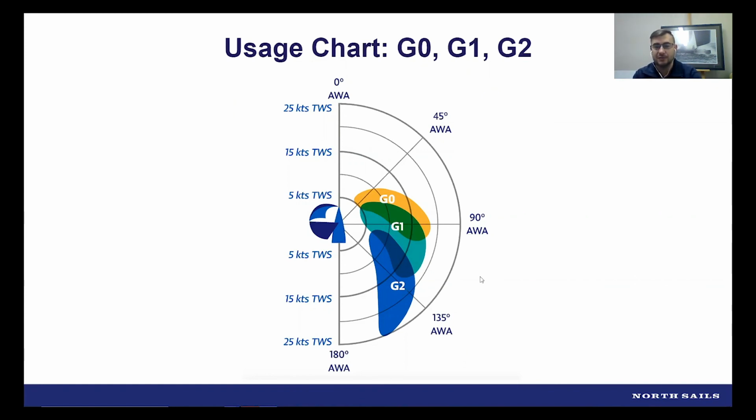One of the tricks that comes from the skiff days is with an asymmetric spinnaker, if you're jibing around the outside, you need to ease loads and loads of sheet. Make sure it comes off the drum and that you're ready to tail in. If you're jibing on the inside, you need to hold the sheet for just a little whisker of time as you go through the eye of the wind, prepared to jibe the sail, and that will actually help keep it back from the luff and prevent twisting. So I think the biggest thing is knowing the angles in and the angles out, and working as a team to release the sheet at the right time. There are two different ways to jibe a spinnaker, around the outside and through the inside.